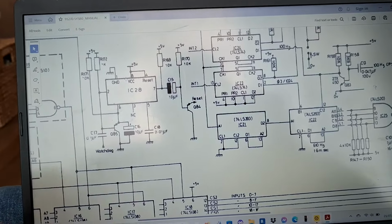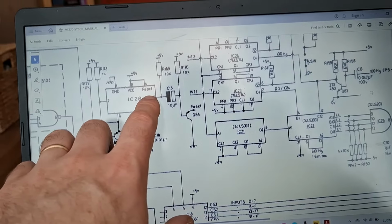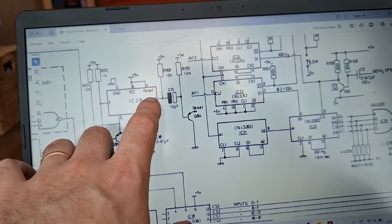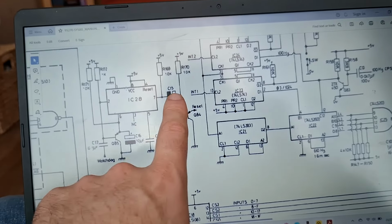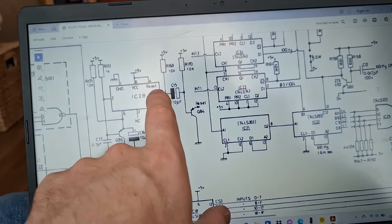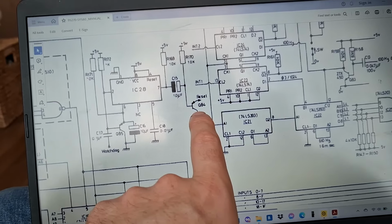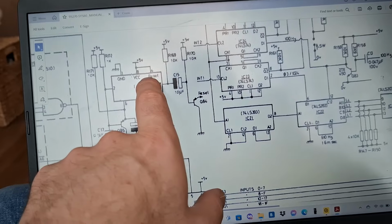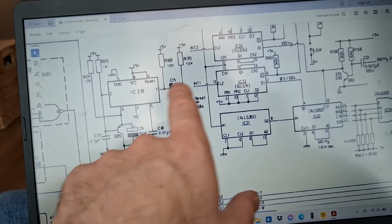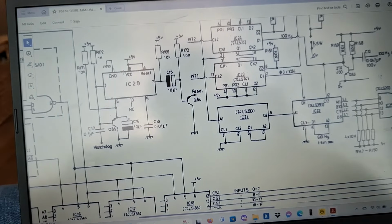And thinking about it, it is, like I say, for the third time, the clue's in the name, discharge. Pin 7 discharges the timing capacitor with the 555 so that the cycle can run again. So it made more sense as a designer to take advantage of this capacitor discharging to pull power away from here and turn this on. PNP, remember. It also guarantees that once this is discharged, this is then blocked and this turns back off. Following it?